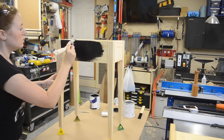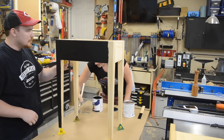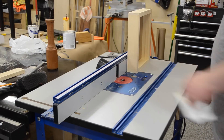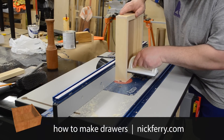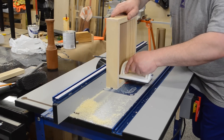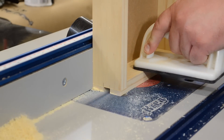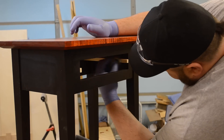The next morning, Jay and April got started on painting the base with a flat black water-based paint. For the drawer hardware, I was just going to use some wood slides, so I attached some runners to the inside with a couple of brad nails and some glue. I then made a simple drawer off camera — if you're interested in my drawer construction methods, I'll have a link in the description. Then using a straight bit in my router table, I made corresponding grooves to match the slides in the table base itself, doing this in two passes. I also applied a little bit of paste wax to the drawer runners.